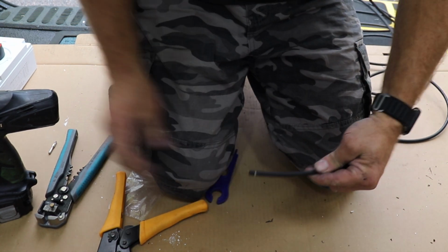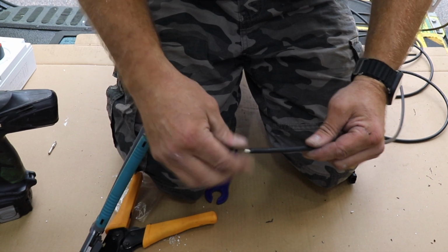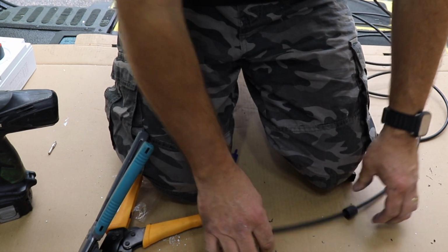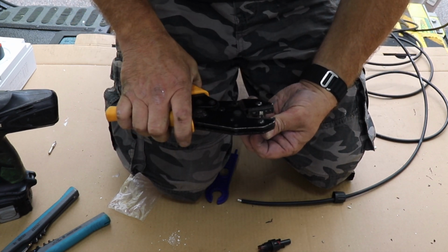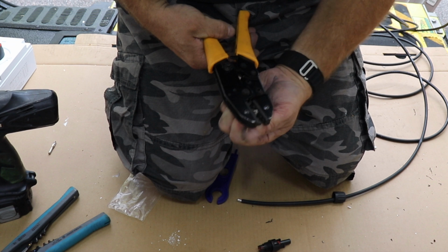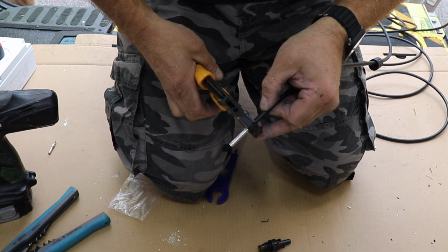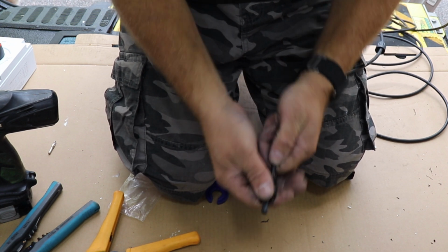So this is your wire. If you're doing it with cable strippers, you just put it into the right place, do it, and that would just chop the end off. So once again, undo the screw off the end, give the cable a bit of a twist just to keep it tidy, screw onto the cable, into your crimps, just so it holds it, line it up right, cable in, and tighten it down. Push it in, and there it clicked into place.